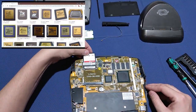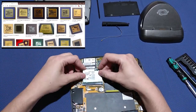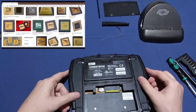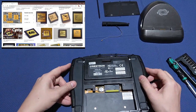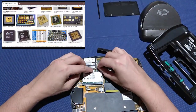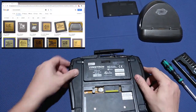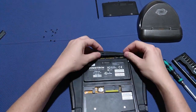The processor is an extremely efficient AMD Geode at 500 MHz, originally created by a company called Cyrix in their Media GX design. They were well known for their competitive products in the 90s and hit a rough patch when merged with National Semiconductors, but their legacy still lives in this panel.